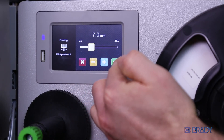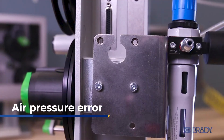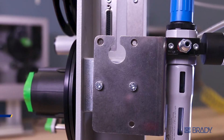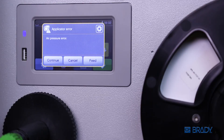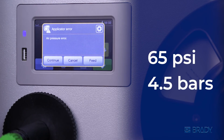Adjust the X and Y directions by one-tenth millimeter increments. An insufficient amount of air pressure, the air regulator malfunctioning, or the failure to properly set up the A8500 may result in the loss of air pressure. An error message will warn of an air pressure error. Begin by ensuring the printer has 65 PSI or 4.5 bars.